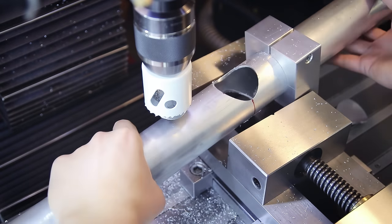I set up a little jig on the table again, mostly to measure and fix distortion. In this case the mitering is also quite easy because I built the two side pieces as one piece, which allows me to cut them apart and miter them in the same operation. All I need to do is cut the miter right in the center at the right angle, and then I end up with two separate pieces which each need an additional miter on the other end to interface with the upper side pieces.